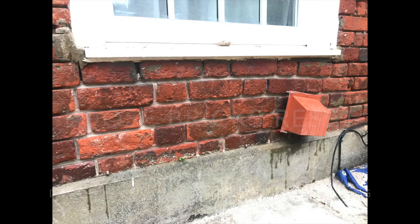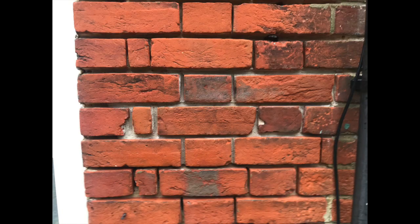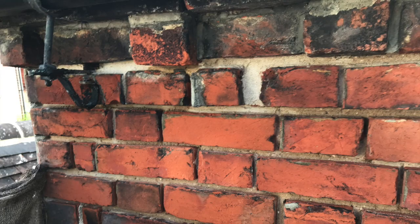So we'll deep repoint that, then rake out a bit more, repoint, and then final repoint. There you go — they're reset, up and down, but that's how they were. Reset as well. Bricks put back in — original bricks. Repoint is in there.